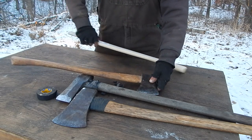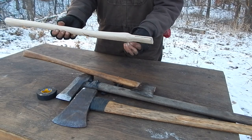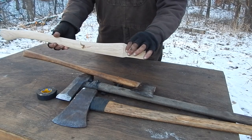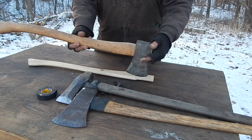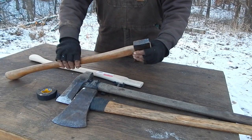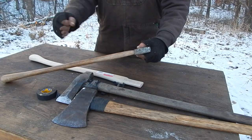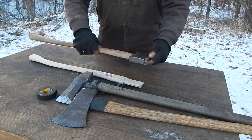I was going to show you something I talked about before. When you get a handle, a lot of times they come like this — with a big shoulder. That really doesn't do you any good unless you trim it down and move the head back. It concentrates all the stress right there. You can see on this one I've thinned that all out, taken it completely down, got rid of that big hump on top. You don't need it. It actually makes the stress spread out over a larger area. Otherwise you'll tend to break them right there, particularly if you do any twisting. This way the whole thing can flex over a bigger area.